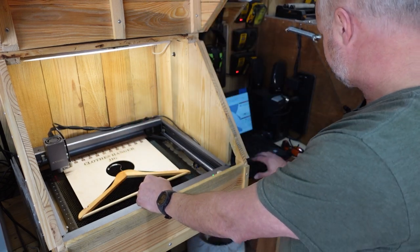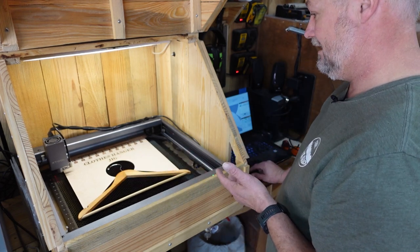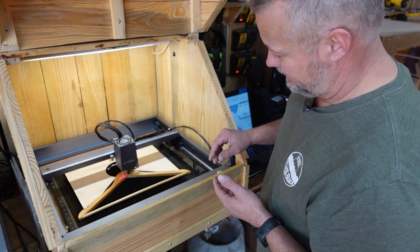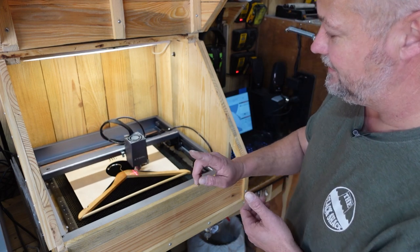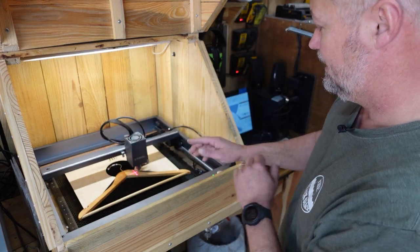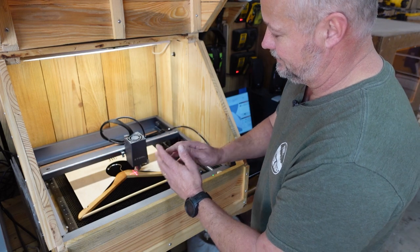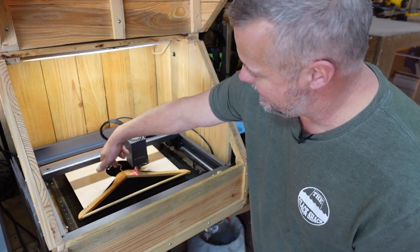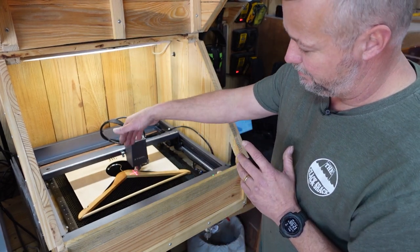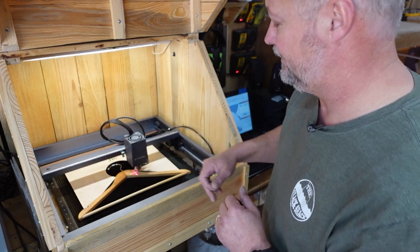The file that I have built — I'll show you real quick. I'm going to frame the area I've got set up to engrave. It's a very small area, but it's the only usable space I have. One thing you have to be aware of with these clothes hangers is because of that rounded shoulder on either side, you're going to lose a little bit of your engrave area. If you start trying to stretch the letters too wide, you can go off the material. So always frame the complete burn before you send it, just to make sure you're not going off on the sides.